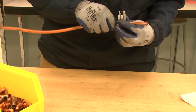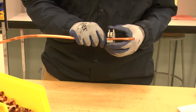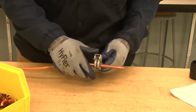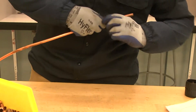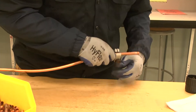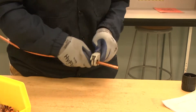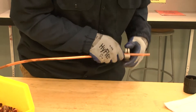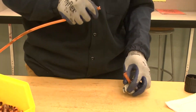You have to make sure it's consistent and you keep going. I usually check back and look at it — I'm not doing it too fast. Keep going until you feel it loosening up, then tighten again. One-eighth of a turn, tighter, not too hard — if you do it too hard you can bend the pipe. This takes a while because this is the smaller cutter. You can kind of see when it's almost falling off, and just like that, it's gone.